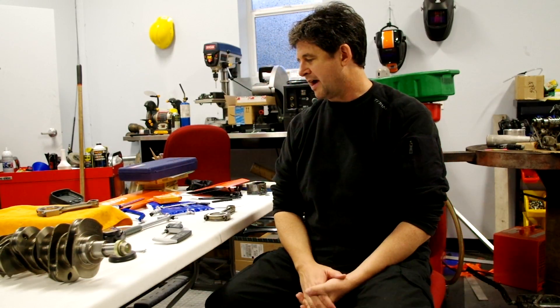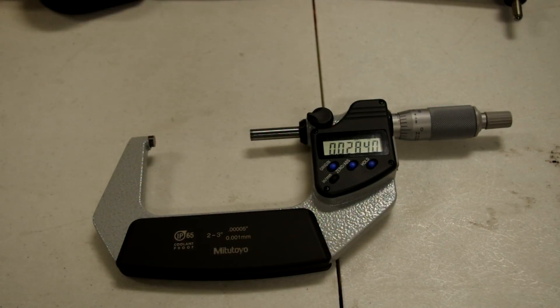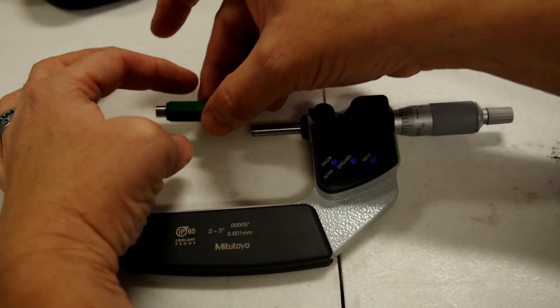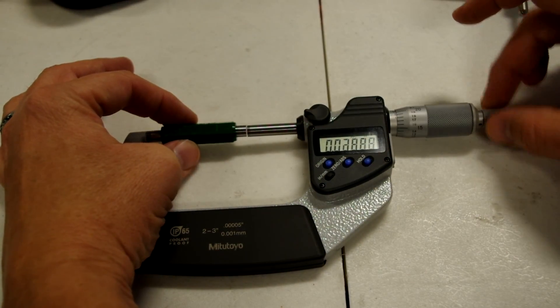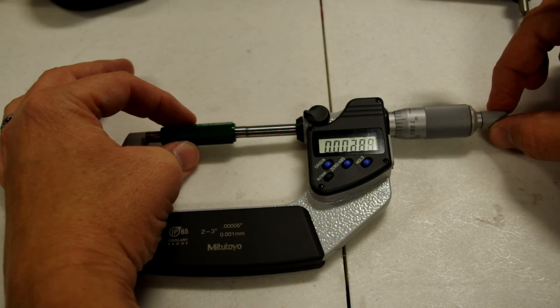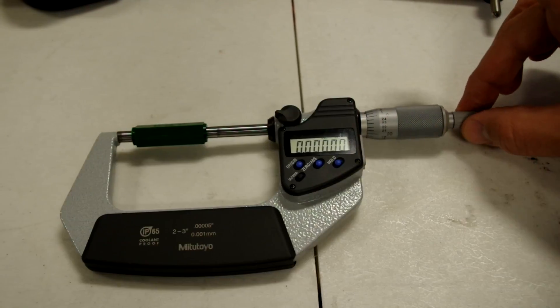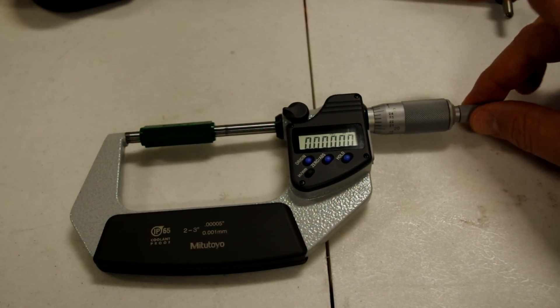I'll show how I made the measurements. We're going to start off by calibrating the bore gauge to an absolute reference. It isn't actually critical to do this since I'm looking at relative measurements, but it's a good step to verify everything is working and to double-check at the beginning and end. We'll put it in there, tighten it down — sure enough, it's right at zero. This is pretty well calibrated.